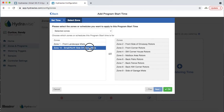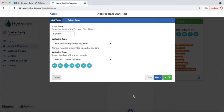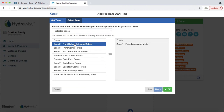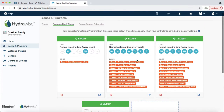When you look at this, everything's watering except the landscape zone. Add one more start time — say Tuesday and Thursday at 5 a.m. — and select only the landscape zone. You could do as many start times as you want; I've had houses with up to 10. When you're done seeding, you can trash those extra start times and revert to normal using 'Apply to All Zones.'